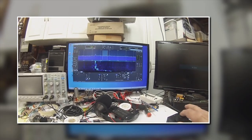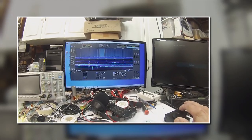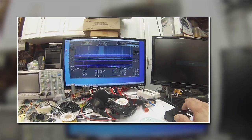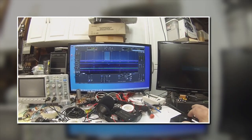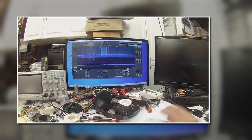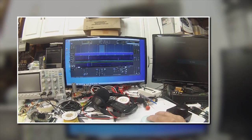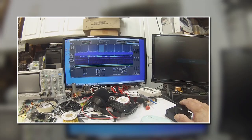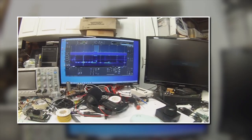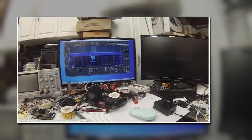We're moving across 40 meters right now in one kilohertz increments because the default is set up for one kilohertz. But if I put it over here on this digit, that's 100,000 — so we're tuning across the bands. That's 20 meters now, and that's 17 meters, and that's 15. If I move it over here to this digit it moves down, so we're back at 40 meters. Move it over one space and now we get into the ham bands.